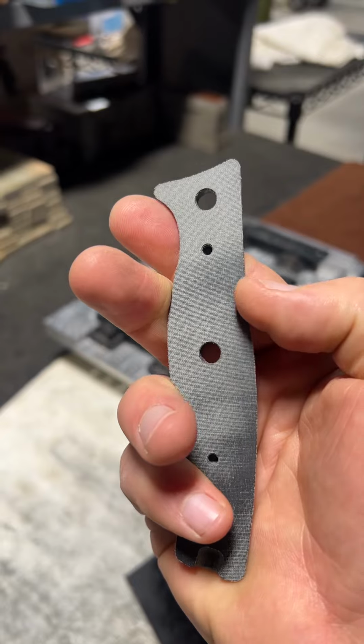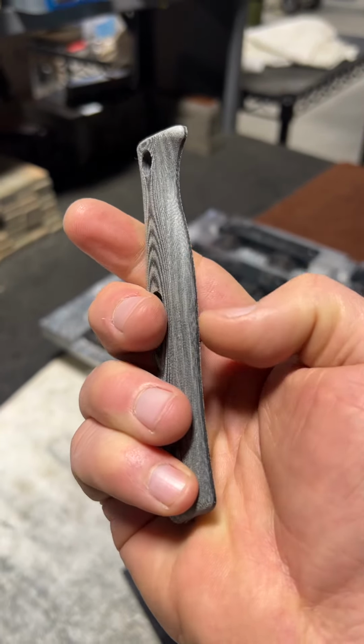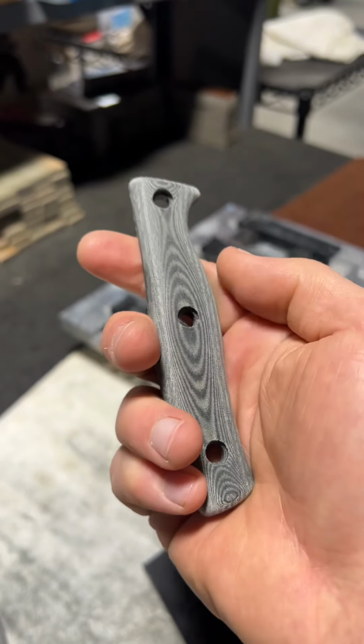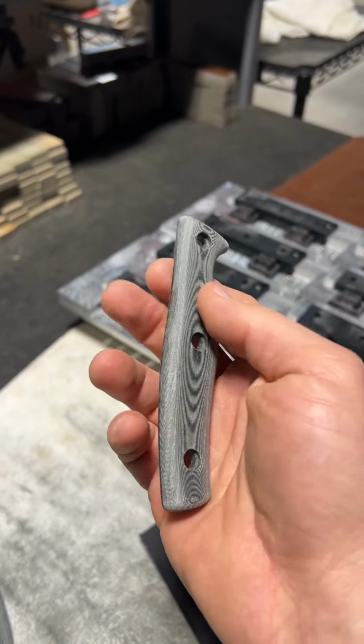None of us really appreciate how that looks for the fit and finish. So we like to get all those visible threads off of the edges of the handles so that everything is clean and aesthetic. And then there's always a little ball end mill pattern here that I erase in microtexture, which again, you have to be very careful so you don't affect tolerance.